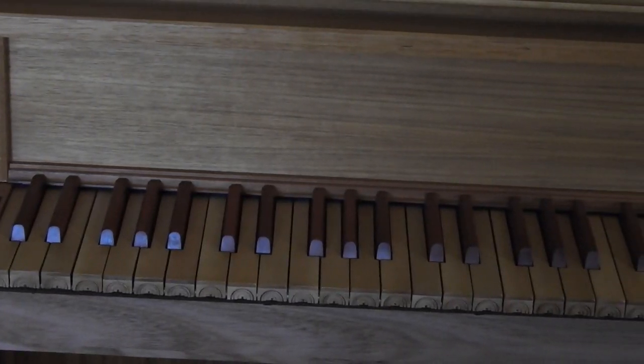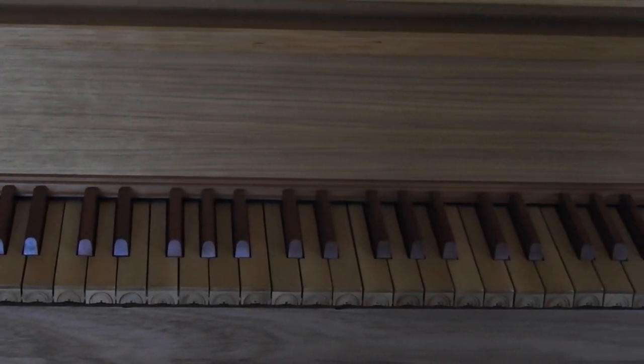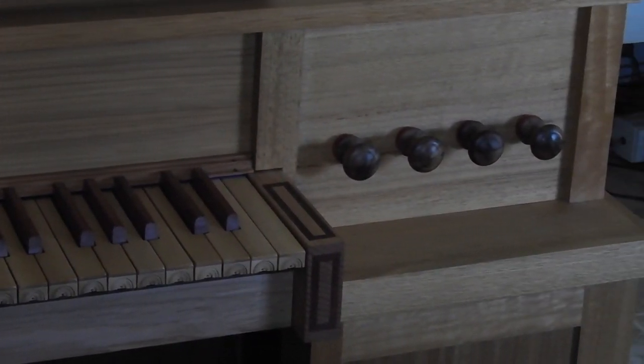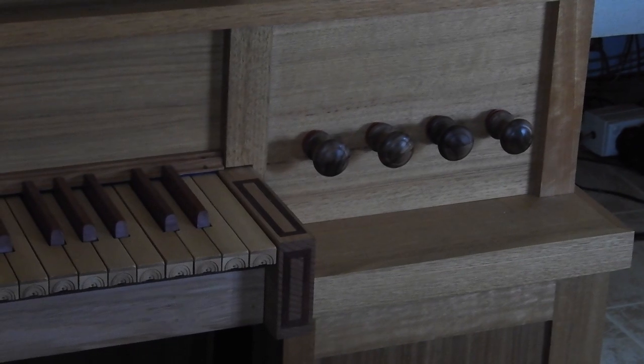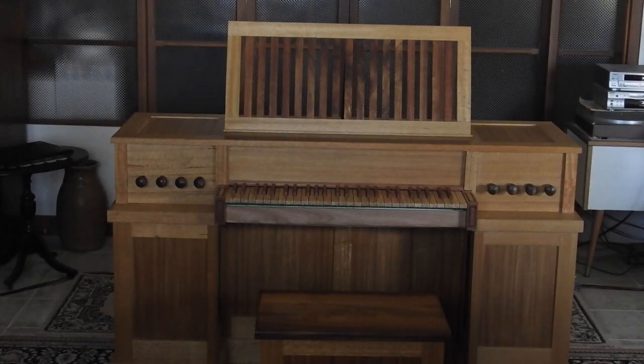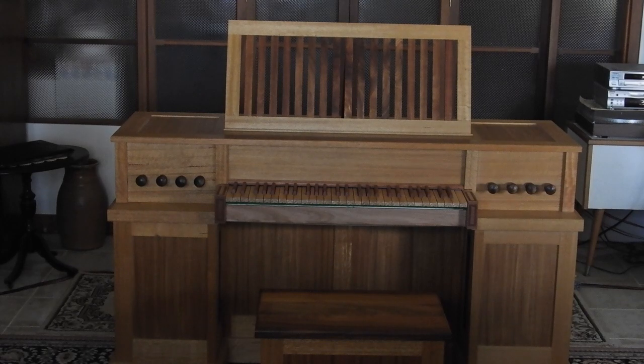The magnets are placed directly on the surface of the key in front of the sensor. The firing point of every key could be regulated by turning a small trim potentiometer. Due to very good resolution, this contact can be used in places where the travel of the key surface is very small, in the range of 1 to 2 mm.